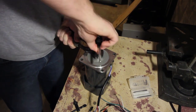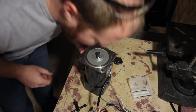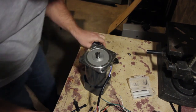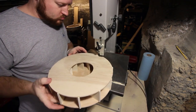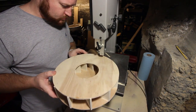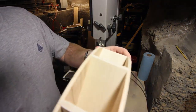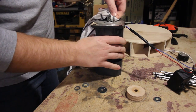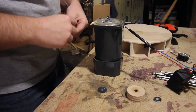This ended up working in the long run — I just had to use a much longer screw than I originally intended. Now that the motor is finished, we can complete the assembly of the impellers. I left the fins a little bit long so that I can trim them flush with the rings. After some sanding, the impeller is ready to go. The final step for the impeller is to glue the coupler to the ring of the impeller. I used a series of spacers as a standoff to keep the coupler from riding along the housing of the motor.